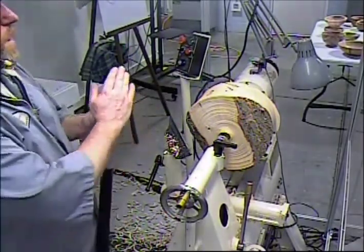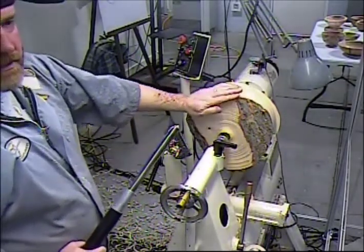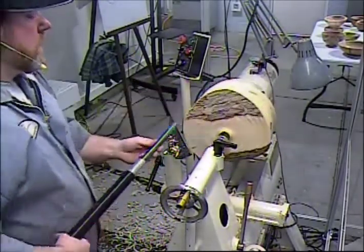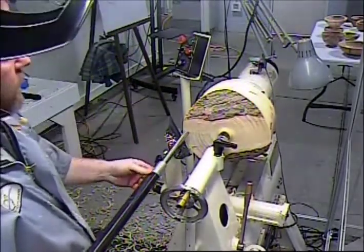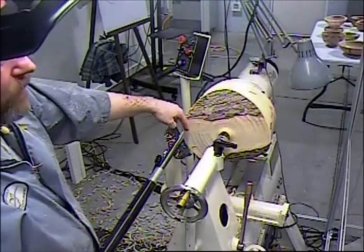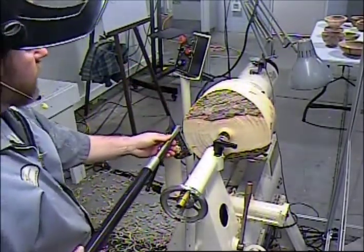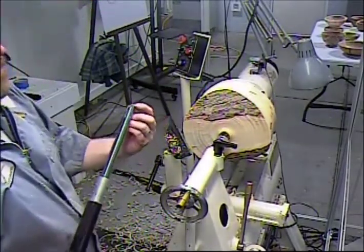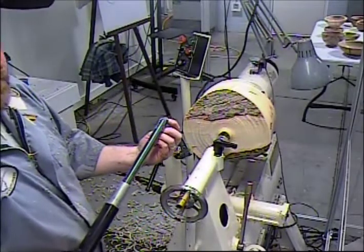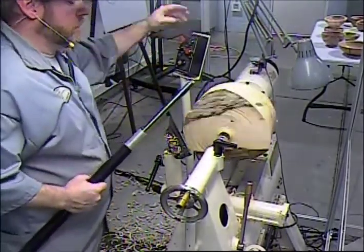If the cutting edge is at 40 degrees, and we want to take off about that on this corner, if I have my bowl gouge set parallel to the bedways, that means my bevel is at that angle we want. By simply pushing straight in towards the headstock, the tool will be forced to ride the bevel and create that angle. So let's see how that looks.